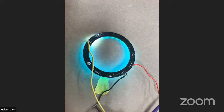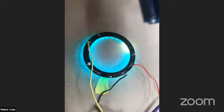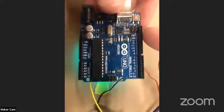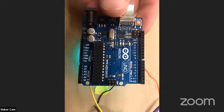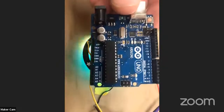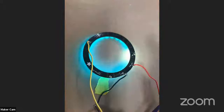In order to get started with the programming, let's get the NeoPixel all wired up. When you first start with electronics and pick up an Arduino, your very first program is called Blink — you put an LED with two legs into a positive and a negative, and you're just running it like a light bulb on and off. Your first program is probably going to be putting it into pin 13 and ground. The real step forward is when you go from two connections to three connections.